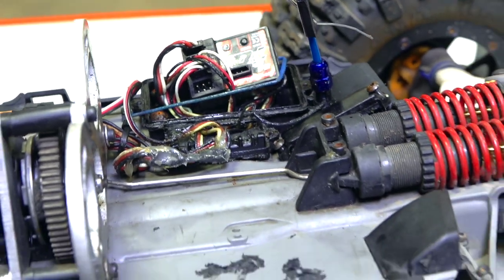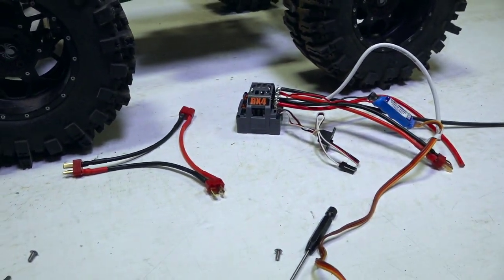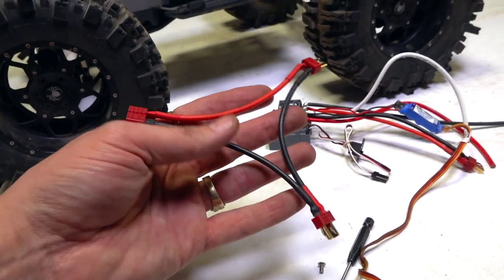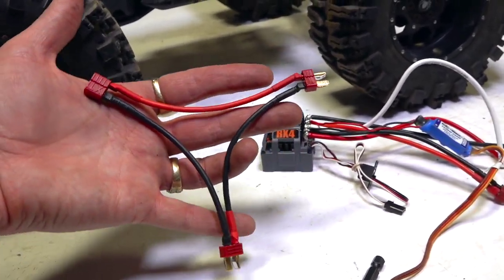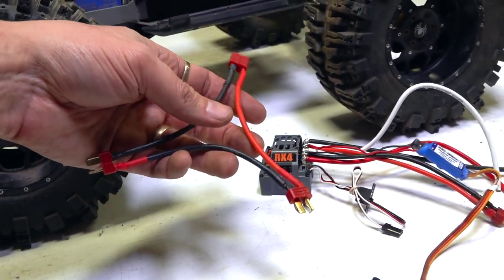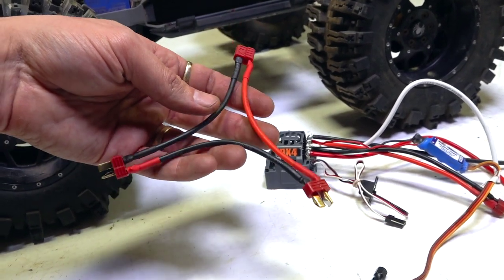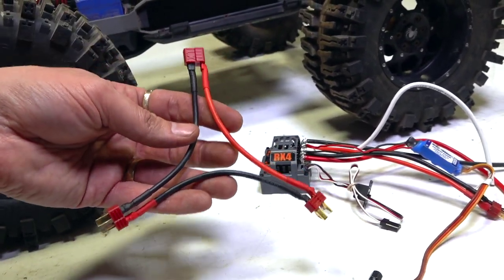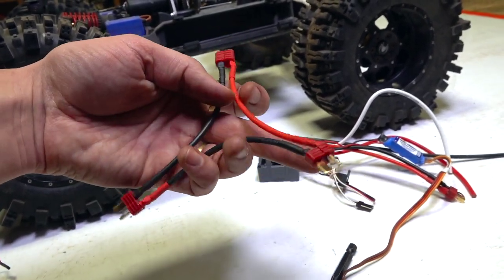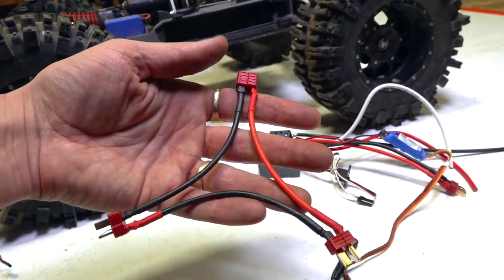Now after about an hour of being off camera, I've actually gone ahead and done quite a bit of the soldering and some electronics work already. I'm going to be running the batteries in series, which basically means I'm doubling up the battery power — so I've got a 2S LiPo and a 2S LiPo for a 4S LiPo. I made this little connector so you can kind of see how it goes: this one going to the battery, this one going to the battery, and this one going to the ESC.